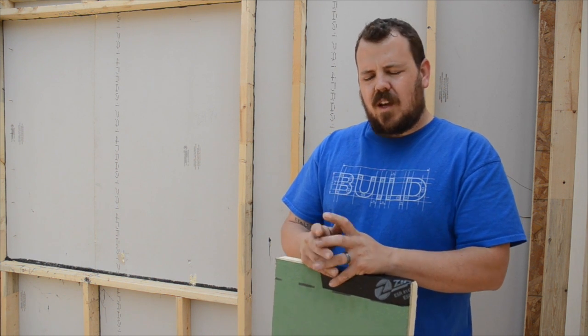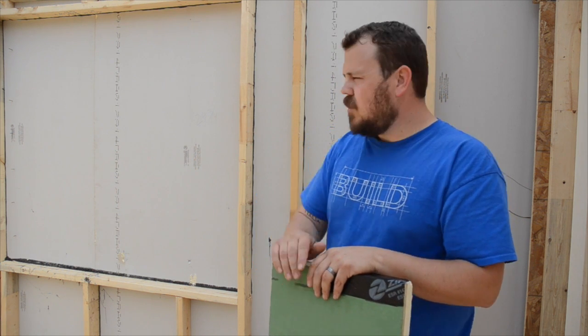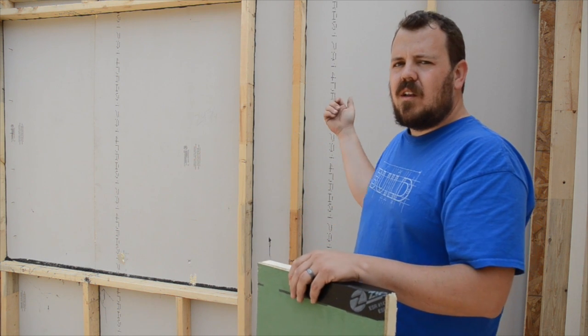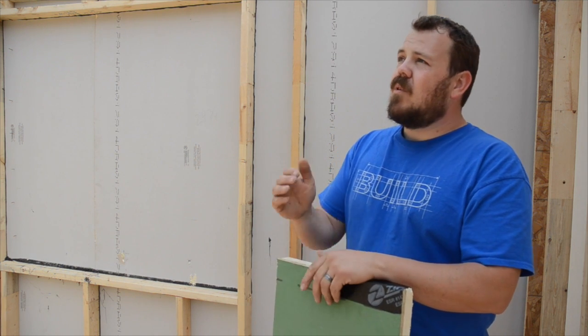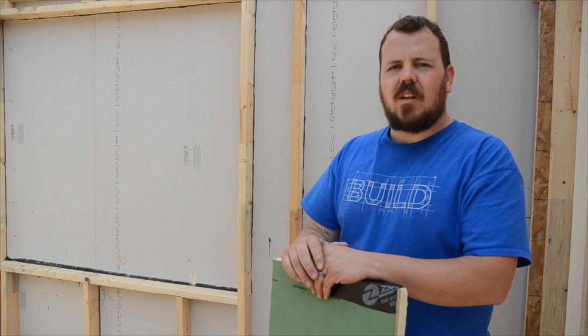One of the things that helps us do that is this zip sheeting. This opening behind me — we're in the master bedroom — is a window that looks out into the forest basically behind this house. It's a great view, but you can't see that because we've gone ahead and left everything in place for now. We've even taped the seams on the outside so that we know we're airtight. That way we can come in and add our ceiling, our lid. Once it's taped, we have an envelope and we're ready to test.